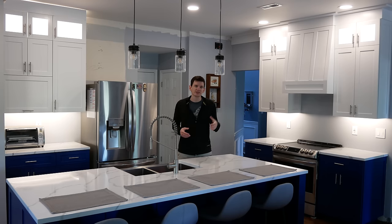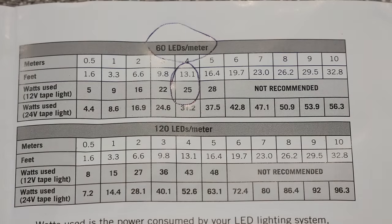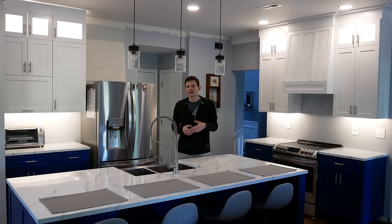In addition to the path of your wiring and location of your LED light strips, there are a few design considerations to account for when planning your cabinet lighting. I've included links to resources that will help you design your lighting in the video description. You'll want to make sure your lights are the appropriate color temperature for your space — I chose 3K LEDs as they match the color temperature of my overhead lighting. Before purchasing an LED driver, you'll need to figure out the wattage requirements of your lights. My lights are wired in an array configuration with three separate lighting runs; I added up the total length of my LED strips, which came out to about 13 feet, and determined that at full brightness my lights are pulling about 25 watts. I likely would have been okay with a 30-watt driver but went with a 45-watt one just to be safe.